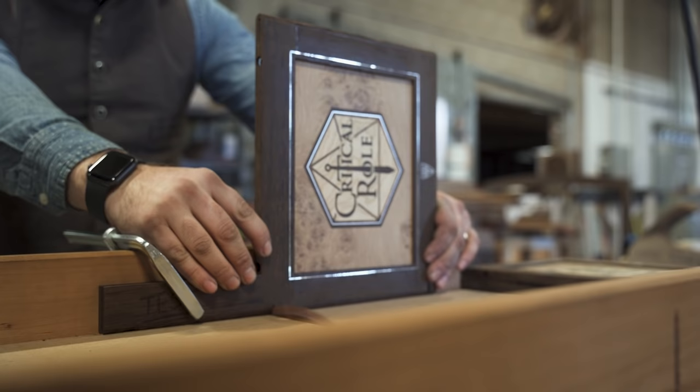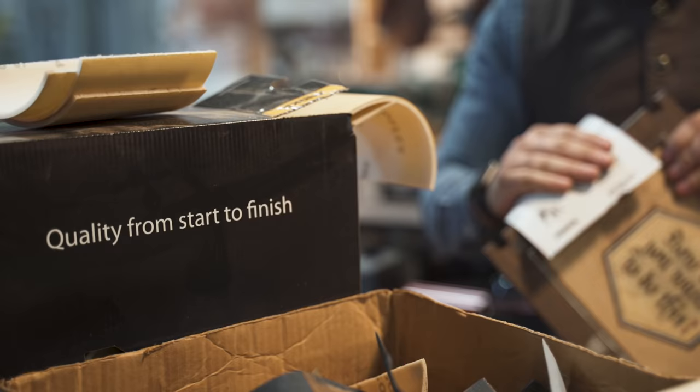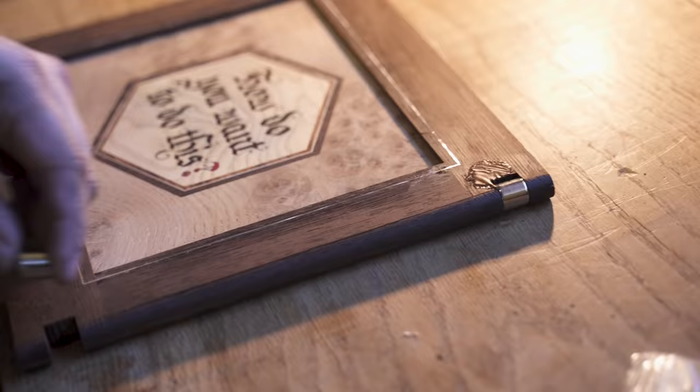Here I'm just cutting out the mortises for those new magnet hinges I had talked about. It's just a matter of using the table saw to cut a small dado just the right size to fit the magnets that you'll see later on in the installing. It's just a really cool new feature that we're probably going to add into future products because it works so well on the screen.